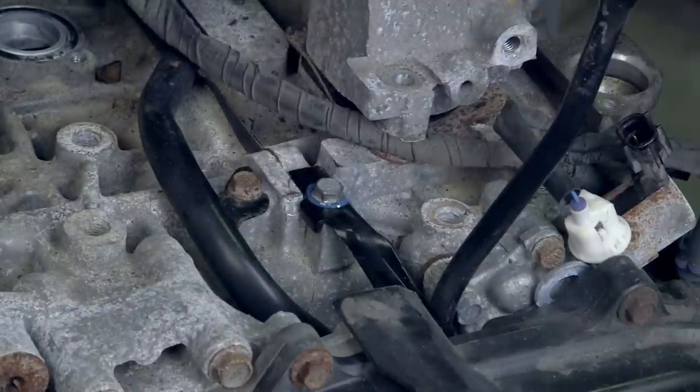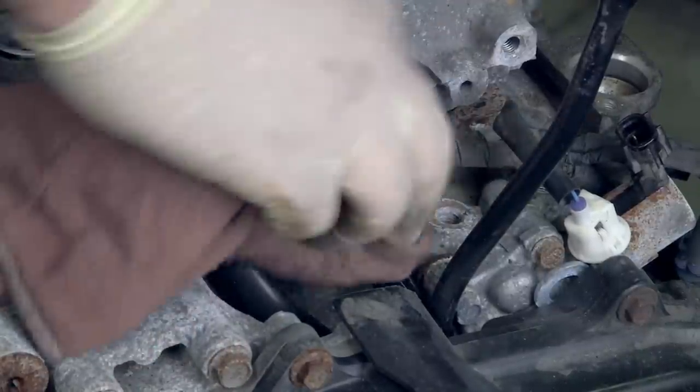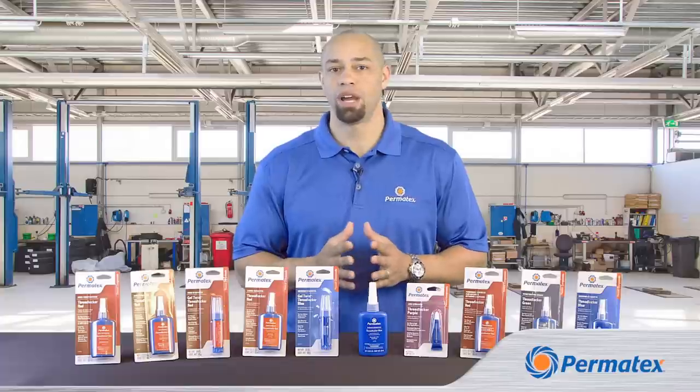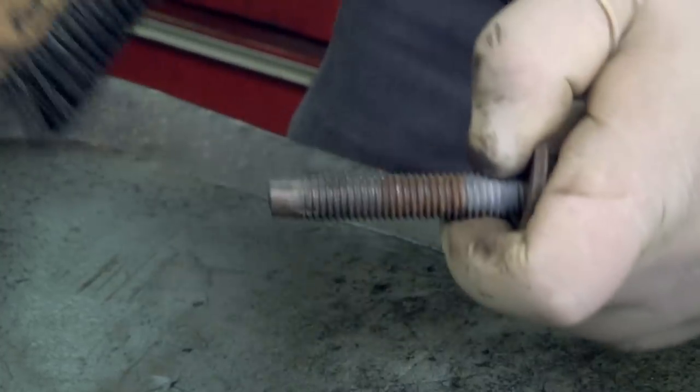Because they're anaerobic, any excess or overspill can simply be wiped away, or you can clean the residue up with brake cleaner or brake wipes. If you ever have to clean cured Threadlocker off a fastener, cured product can be removed with a combination of soaking in Permatex gasket remover and some hand work with a wire or stiff nylon brush.